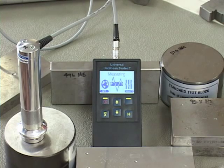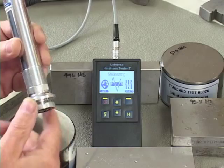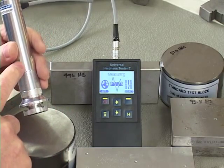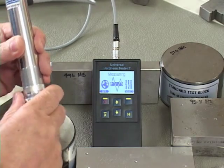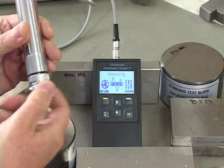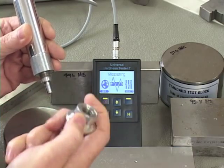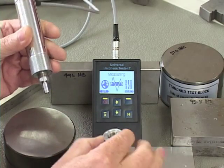Today we're going to be doing a video on the TCM U2 calibration and some other features. First, let's talk about the probe. This is a 50N probe, which means there is about 12.5 pounds of force of load required on the probe itself to activate it and give the correct reading. I'm going to screw off what we call the puck from the end of the device. It has a spring inside so when you press down there is a resistance from that spring.